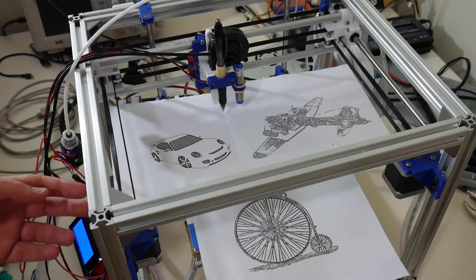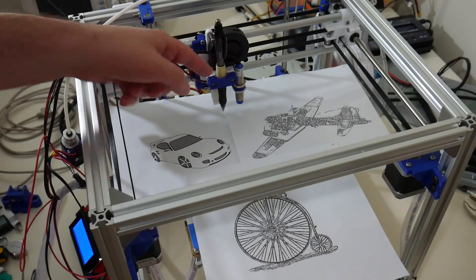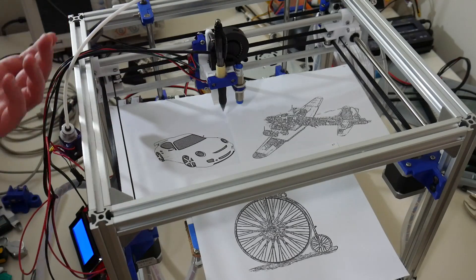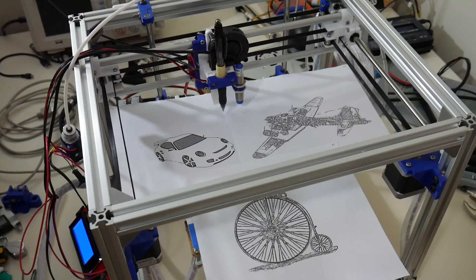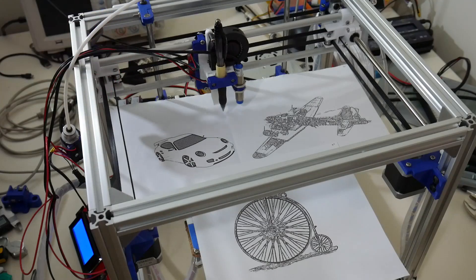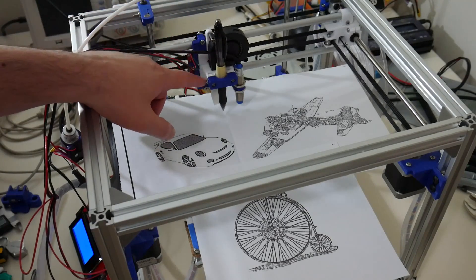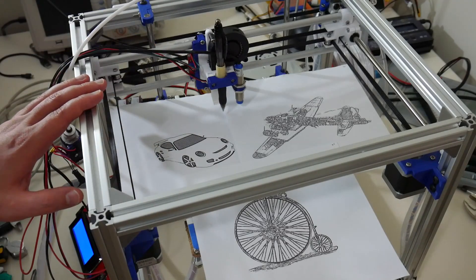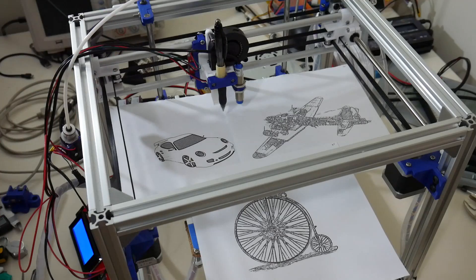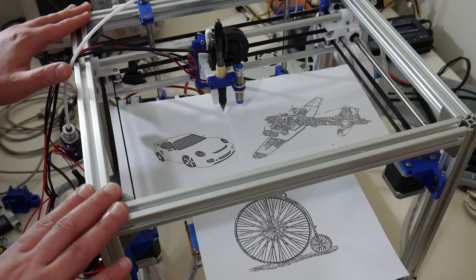You're probably wondering: why use a 3D printer to create 2D drawings on paper, when you can just use a standard printer for that? Well, the answer is we can use any type of pen that can fit into your holder. So we can print in many materials, we can print on top of many materials — it doesn't have to be paper. It could be, for example, a copper plate; you could make your own PCBs. You could print on top of a hard surface, where a normal printer can't. Not only that, I've got bigger plans for this. The Hypercube, or any printer, can be used as a CNC machine. So why limit it to just a hotend when we can have multiple mounts on your X-carriage? So I'll be designing multiple mounts moving forward — a pen holder for a plotter, then a laser engraver, following that a mill for a drill bit, for example. The possibilities are endless. This is going to be a very useful tool moving forward.